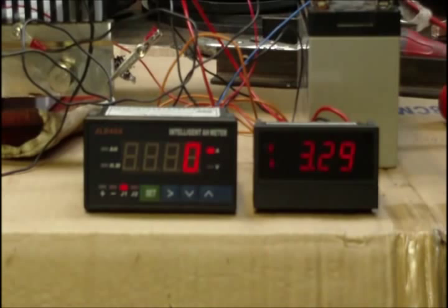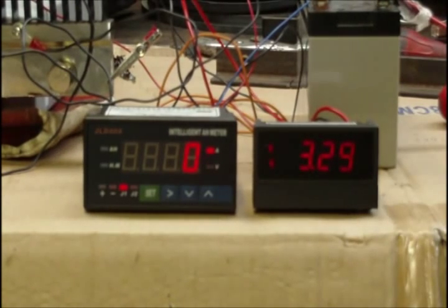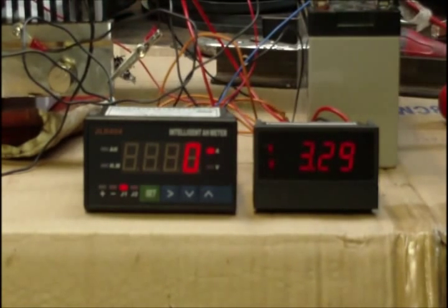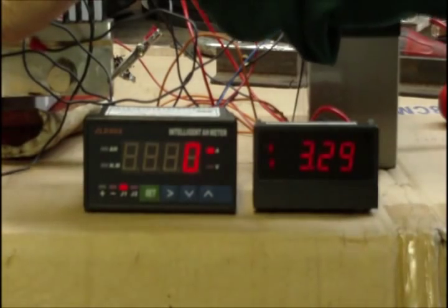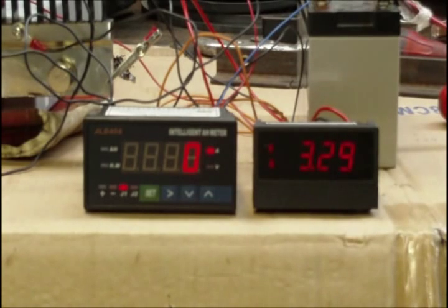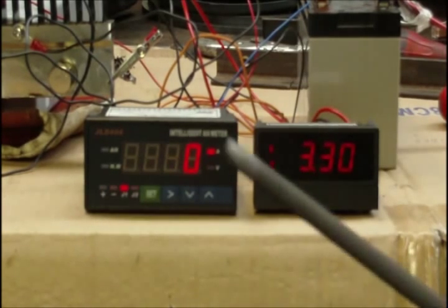So putting my hand on the flat of the cell here, and it's actually quite cool. The copper bus bars are quite warm. Base of the cell is cool. Up around the terminals, the shunt is actually reasonably cool. I can hold my finger on it. Just the copper bars will have basically been conducting heat out of the steel.